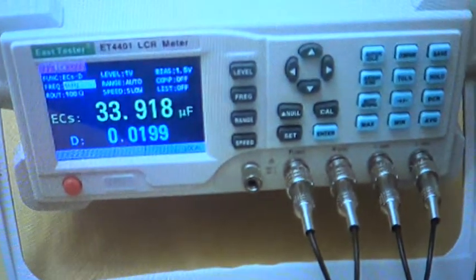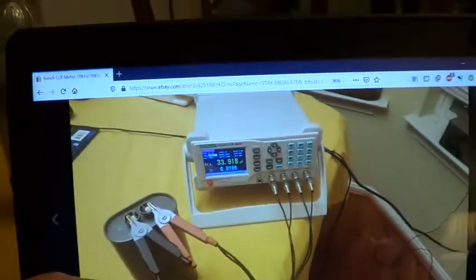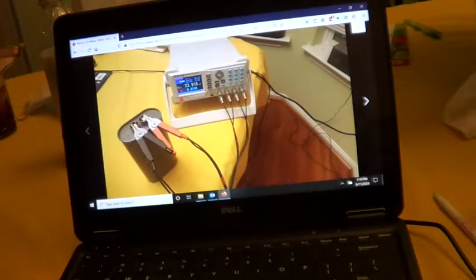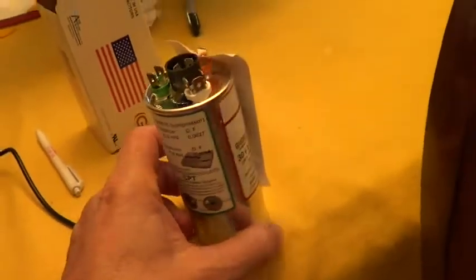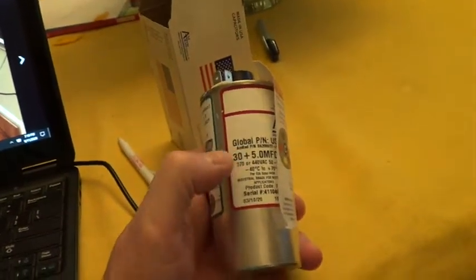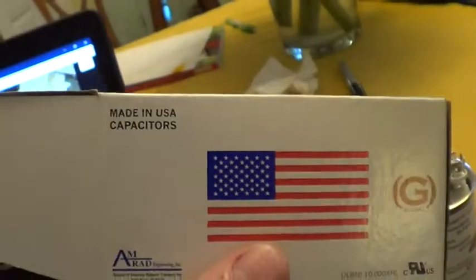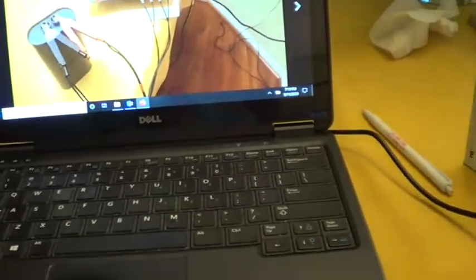Here's the tester I used — it measures capacitance very accurately and then the dissipation factor, or I could do resistance in ohms. That machine turned out to be useless for predicting lifespan because the capacitors that lasted longer were actually worse in resistance, for the reasons I showed in the video. All you can do is get a good capacitor — the Turbo cap is good, I've rarely if ever seen one go bad. These might actually do better. It's the same company, American Radionic — I suggest using their run capacitors. They have a cool video on YouTube; I'll put the link in there. Hope you enjoyed the video, thanks for watching.